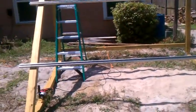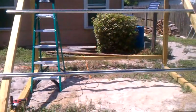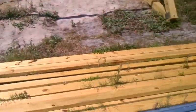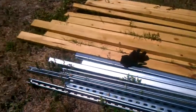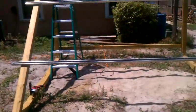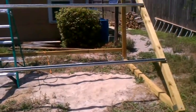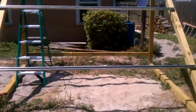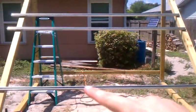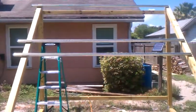I've got gloves on here. You can see the lumber's definitely getting lower, which means we're getting close to being done. You've got the super strut down here — I like it better than the unirac. The spacing on the super strut up here is 48 inches, 48 inches, and then between there it's enough for the ends of the panel.